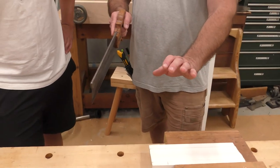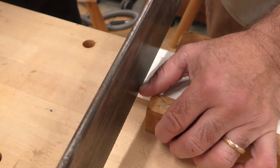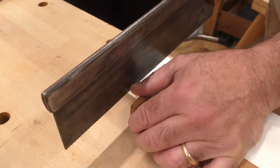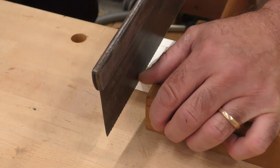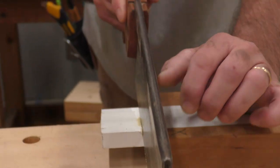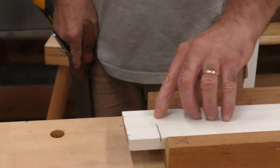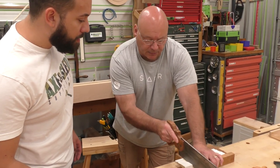Now I position the saw on the line. There's no death grip on this — it's a slight push, and my thumb walks to the line to get started. I start on the pull side. The first 10 strokes are critical. I'm not forcing it; I'm keeping it in line and eyeballing it. My fence is this break right here. I'm taking it back lightly and pushing it. If I had the line drawn all the way across, I'd start tilting it, but for this we'll keep it straight.